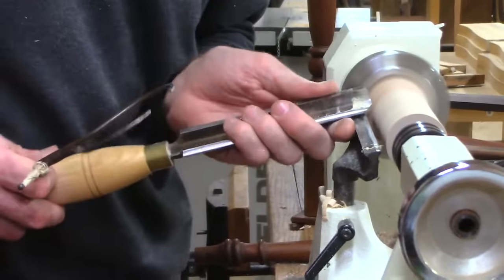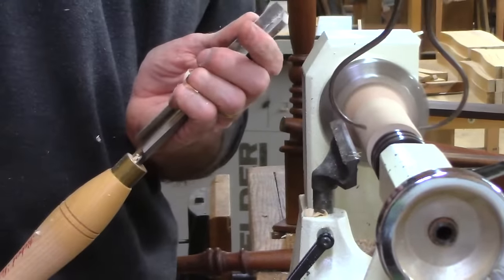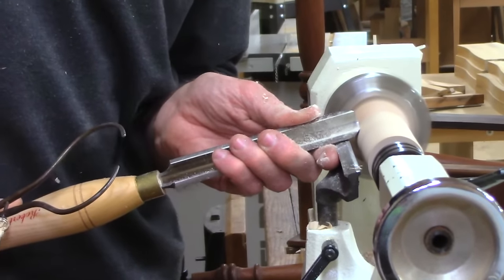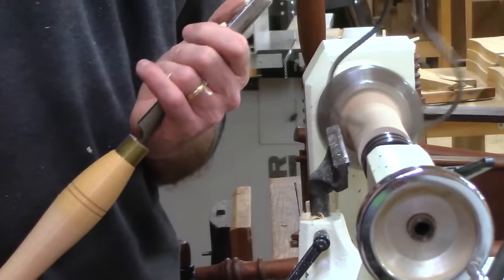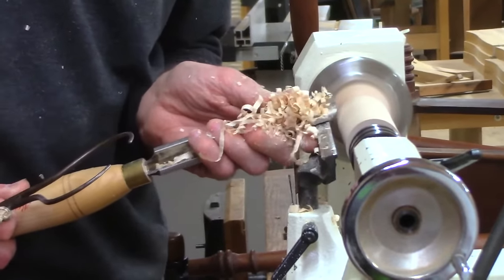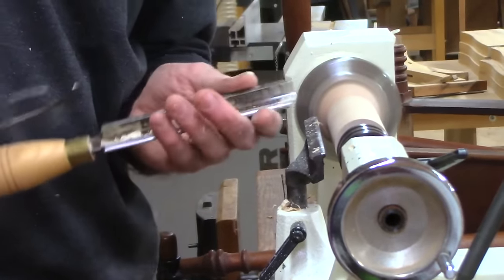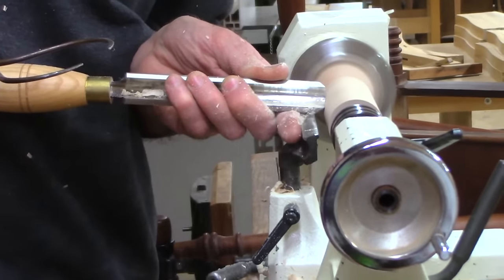Got a little ways to go, not much. Roughing gouge is fun, it's super easy. You're just holding the tool, so once the bevel makes contact, I hold that angle. I'm resting on the bevel lightly, and then I'm getting a nice shearing cut, so you end up with these sweet shavings, rather than coming in perpendicularly and getting a scraping, dusty cut.